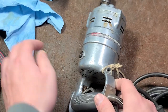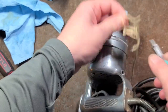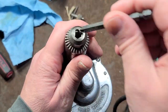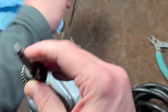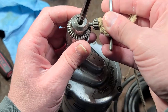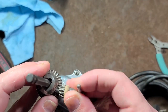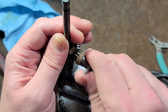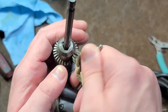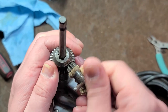So I figured we'd just turn this into a teardown video. Since it does have the Jacobs Chuck and the chuck key, I will be keeping that old Jacobs Chuck. The easiest way to remove chucks — some people use Allen wrenches, but the problem with those, in a case like this with a quarter-inch drill, you'd take a quarter-inch Allen wrench, chuck it up, and hit it counterclockwise to unscrew the chuck. But that puts a lot of sideways force, and generally speaking, if you have any type of impact device, I would use that instead.